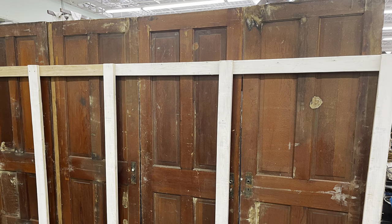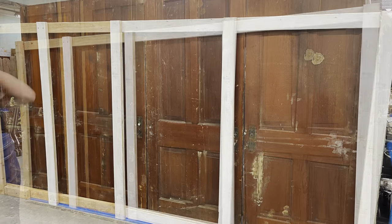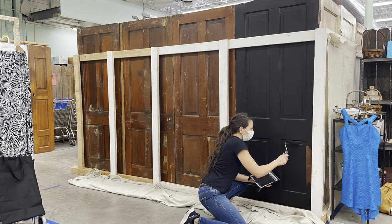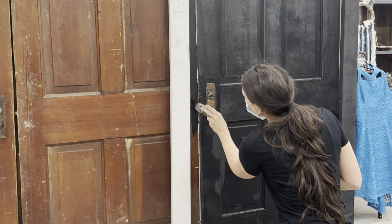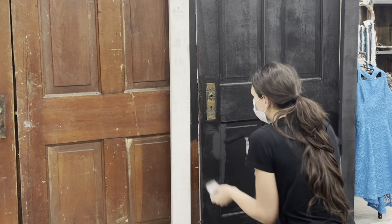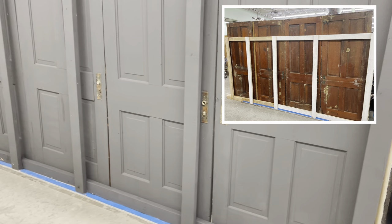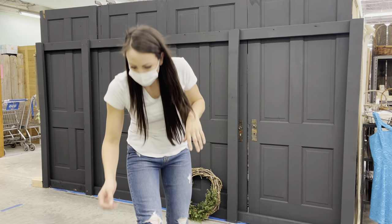It's time to take all of my floral up to my booth. Since I'm going to be there anyway, it's time to get this wall painted using DIY Little Black Dress. Now this is the back of my booth wall — it is made out of old doors, and these are some farm fresh doors covered in who knows what. We are going to use black to cover them all in just one coat and avoid any unsightly bleed through. I used a mini roller and a two-inch zebra cut-in brush. DIY paint is all-natural and VOC-free, which means it has no harsh fumes, and I can paint indoors without wearing a mask or bothering any of the customers with the smell.